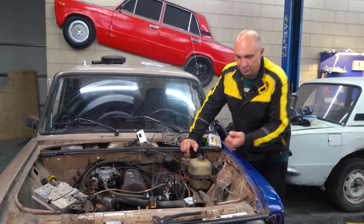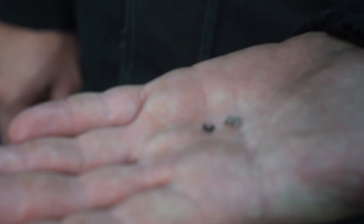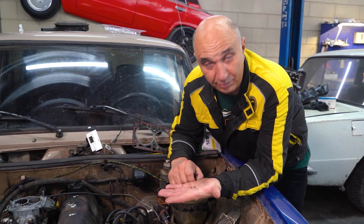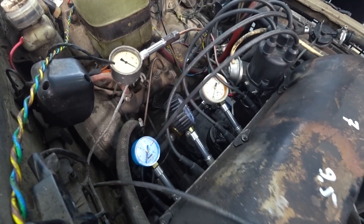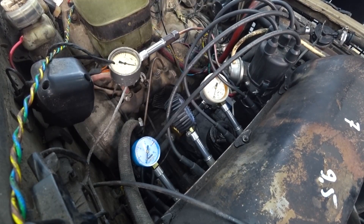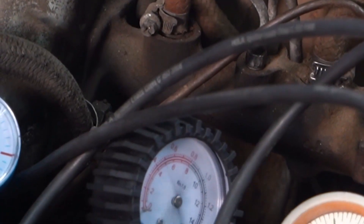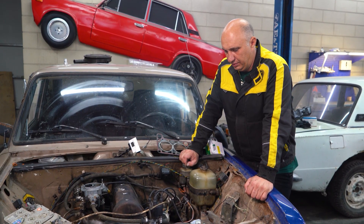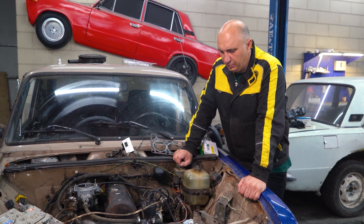Here's the situation — this was very much to be expected. The relief valves are crapping out on us. These bits are falling out: the rubber bit was simply sliced, and the spring is horribly mangled — it doesn't even look like a spring anymore. That's the pressure, and with how close they're mounted, that's also a high temperature. The only valve that survived is the one on the gauge attached to the tube, so we'd better move these away from the direct combustion action. We're going to have to make tubes for the other three.